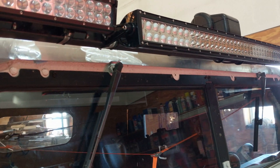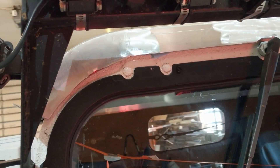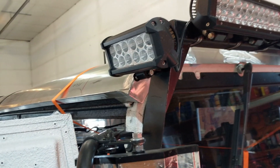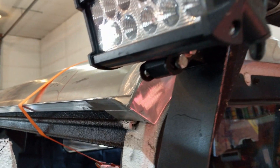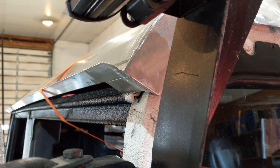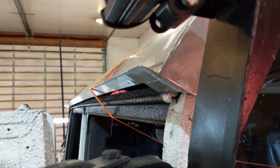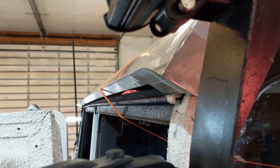As you notice, we cut out a little bit around the wipers there, and then we fabricated in pieces to keep the wind from blowing through and give a nice finished look. Now because I used the soft top window frame, I had to put a 1-inch spacer there — that's a piece of 1x1 aluminum — and then I'll use weather stripping and sealant to seal up that crack that runs along the front driver's and passenger's door.